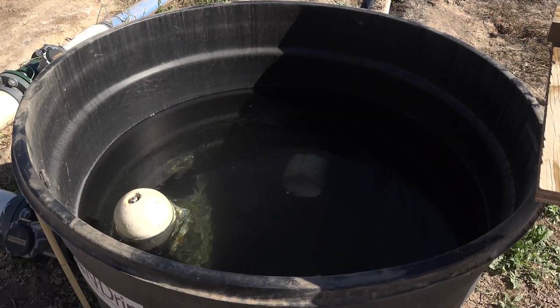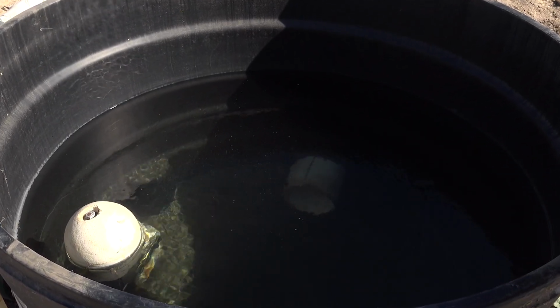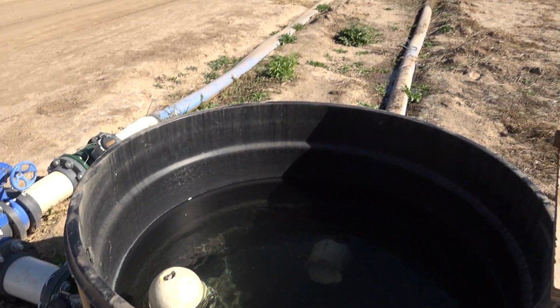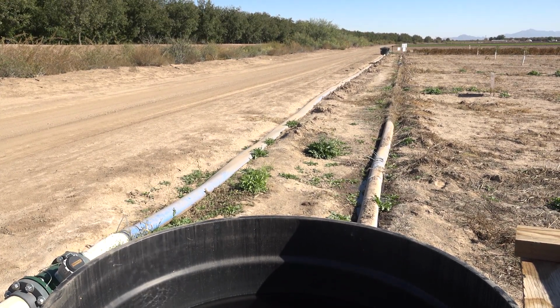So this is known as the microgravity drip irrigation system. That essentially means that we do not need any extra pump or any other sources to pressurize the system. The system operates on a very small pressure, usually less than 100 centimeters. For that purpose, we have some containers where the water is initially stored to create a head, which is around 100-120 centimeters. And under this pressure, the water can flow through all of these drip pipes.